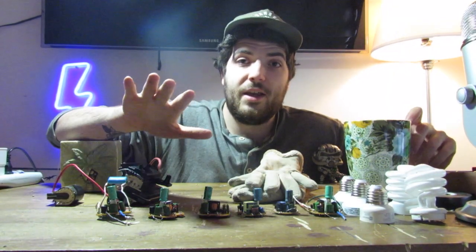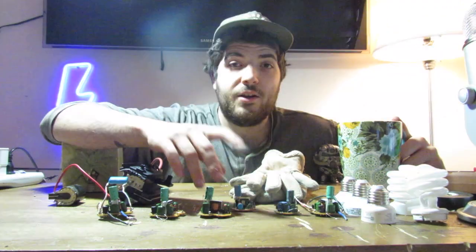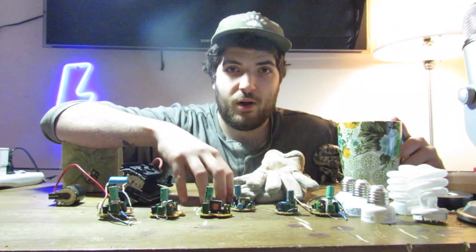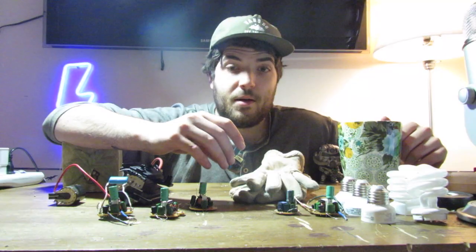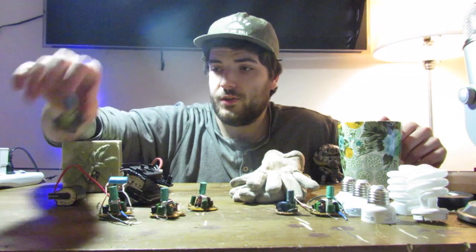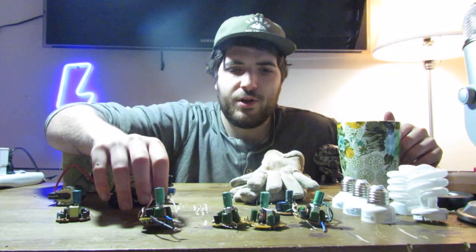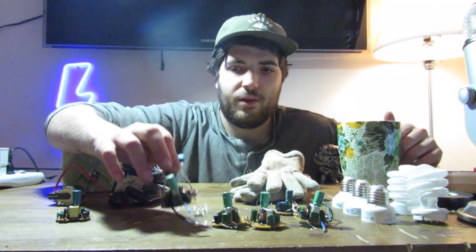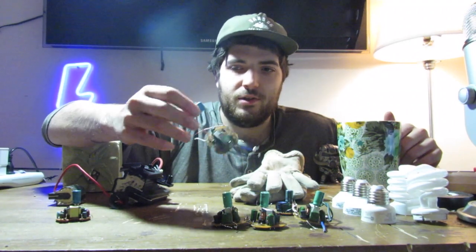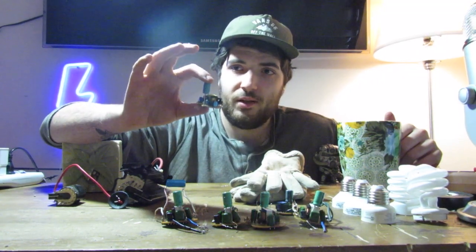Jay from the future here. Let's just say it's been a rough past couple days. The first CFL board I used was the good one — I think that was the 20 watt bulb. And then somehow I blew the circuit out; I think I shorted some wires. Then I got the four pack of 23 watt bulbs, and none of them worked. I'm pretty sure they're the newer bulbs that shut off if they don't sense the bulb. I tried getting around that with a capacitor, but I tried so many iterations and none of it worked. So the only CFL circuit I had left was a 16 watt one.